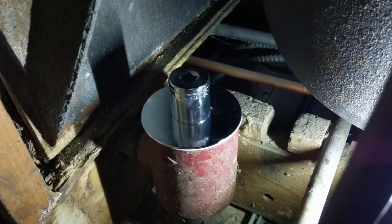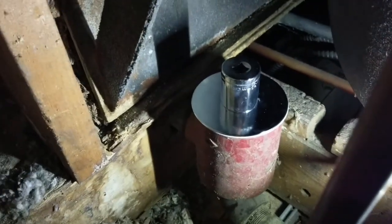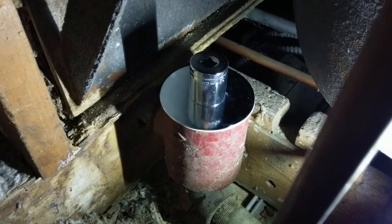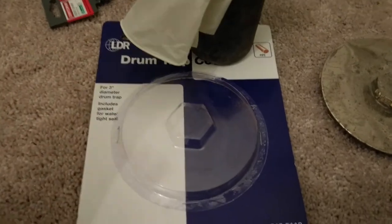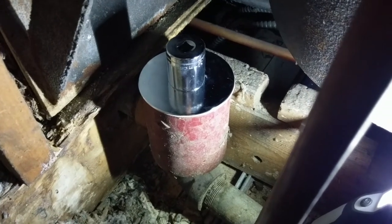Alright, it is time for hopefully the final update on the drum trap cleaning saga. I pulled a bunch of nasty hair clumps out of there - the blockage was actually further down the line, but I suspect I completely cleared it. I got quite a bit of material out, including some from the bottom where it comes up, which wasn't easy to get to even with gloves. I was sticking the zip-it down and twisting to grab what I could. I stopped at Menards and got a new drum trap cover - literally the only one they had. I'm once again using my 32mm socket, which isn't the correct size.